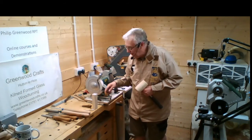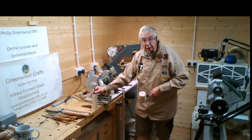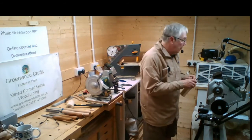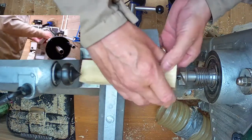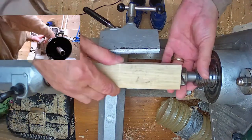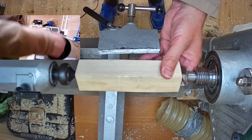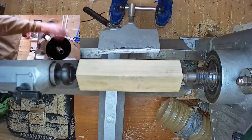There's a bit of a time lag tonight, a lot more than normal. Just put that on there with a mallet so you do not damage the end. Going back to the top camera - we've got enough in there to grip. Move the tailstock up, lock it off, and just wind that in - I just need sufficient pressure for that to grip.